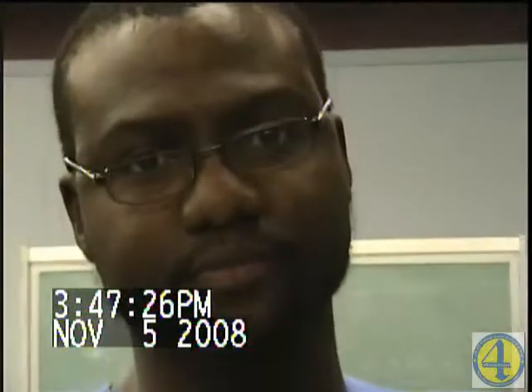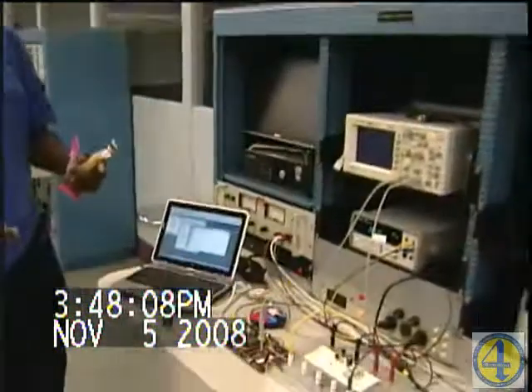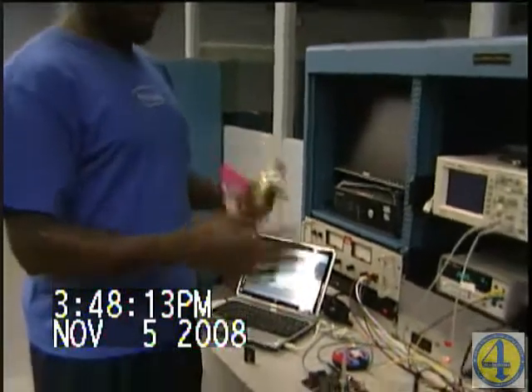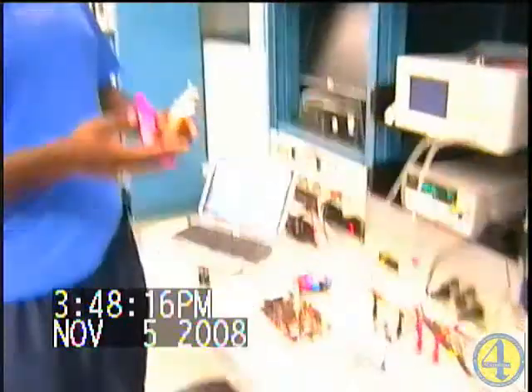An MPP Tracker is an electronic device — a microprocessor control device — used to maximize the efficiency of the solar panel and allow the battery to be fully charged or operate at its maximum efficiency. The core system in an MPP Tracker is a buck converter, which takes a high input and converts it to a low output.